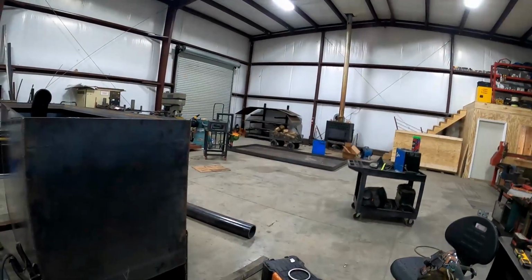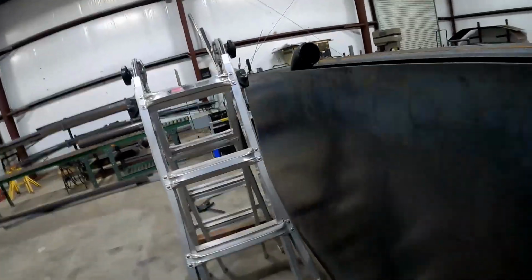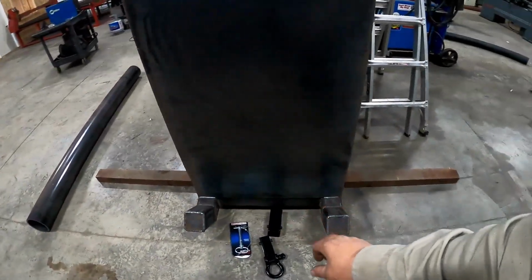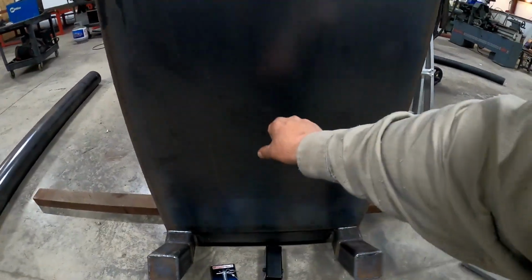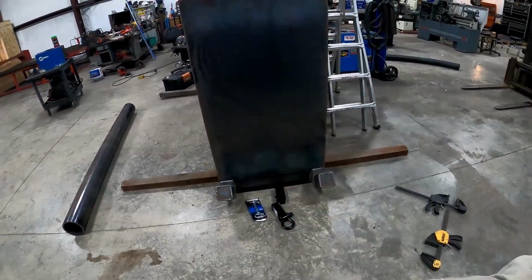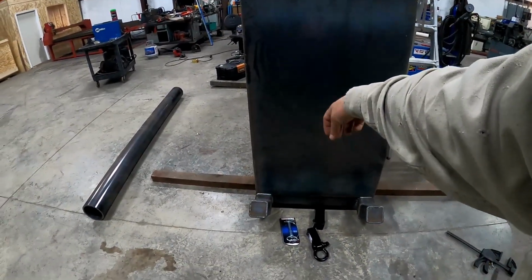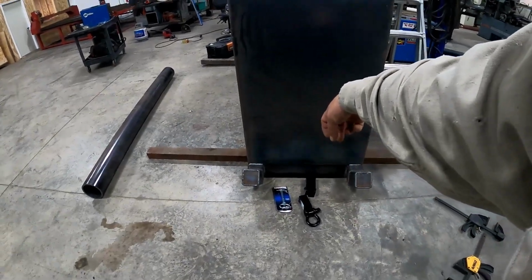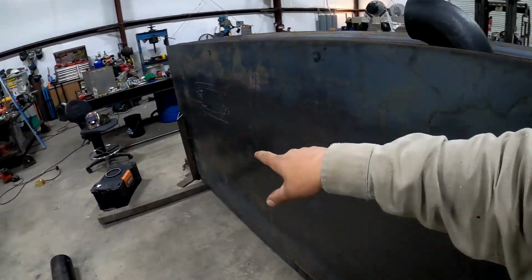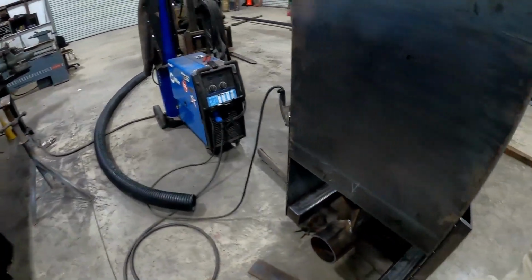that an entire reel of corrugated piping will set on. So as the excavator grabs from the front onto these items where the chain will mount, the excavator will dig back. Once it reaches as far back as it can reach, it's going to reach forward, grab a chain and a tie bar with a hook, and pull the excavator forward, which in turn will set the pipe down in the ground and pull the gravel over top of the pipe.